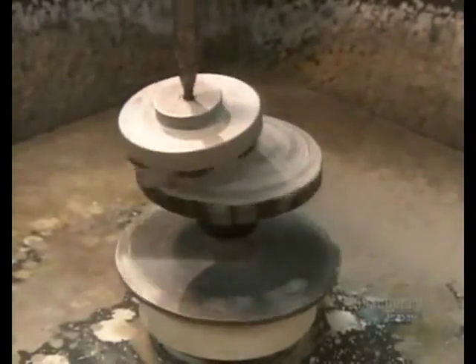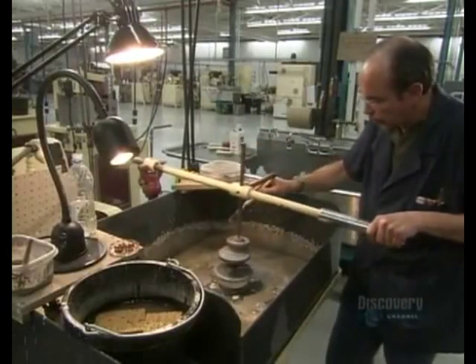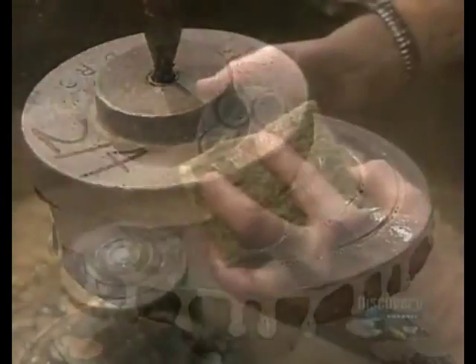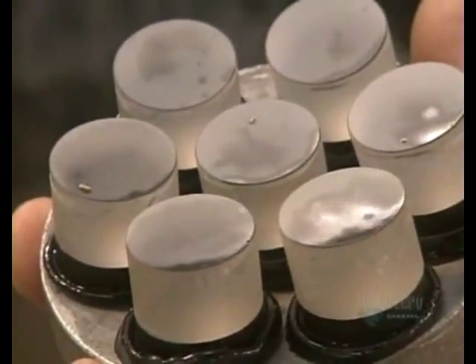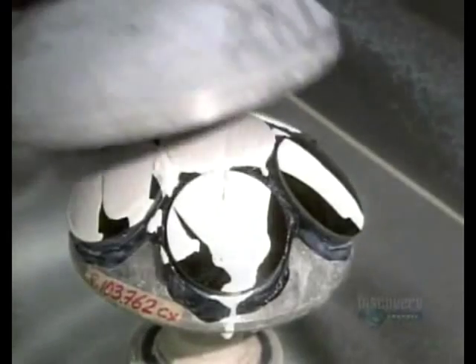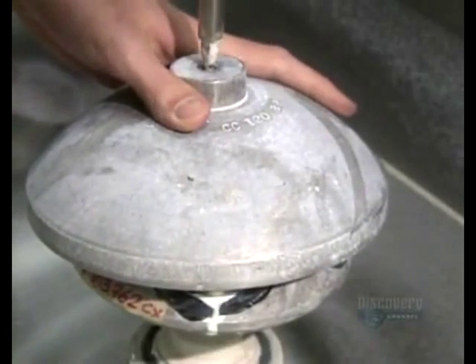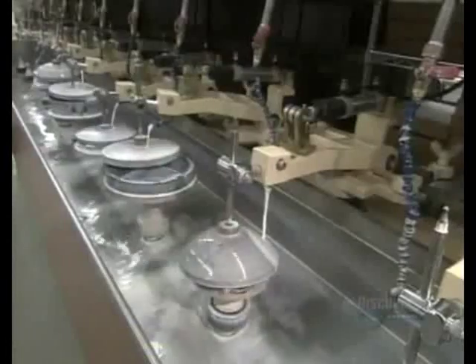The blocking body is now upside down and acting as a holding device as it oscillates on a spinning grinding shell. The grinding makes the surface of the lenses uniform and smooth. They then place a polisher on the lenses, lubricated with a very fine abrasive. For about an hour, the polisher oscillates while the block spins. Polishing makes the lenses smooth and transparent, and also gives them an even more curved profile.